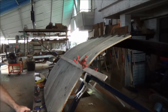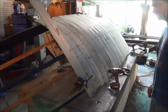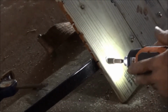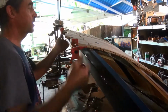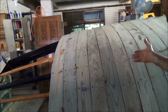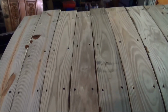Okay. Now I'm going to go get coffee. Well, out of 50 pieces, we're on number 24. And I must say we're closing the gap. Okay, 24 out of 50. As this thing curves down, things get tighter, it gets more and more like a wine barrel. So I found myself having to taper these things to fit at the tops and bottoms. One good example is right over there.